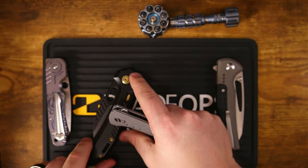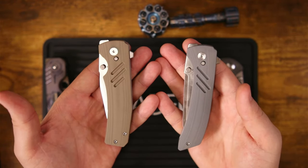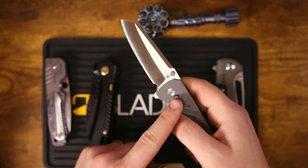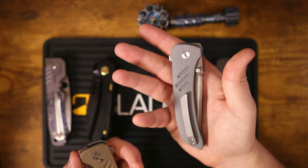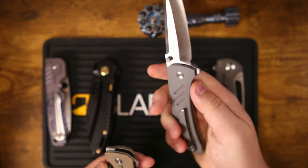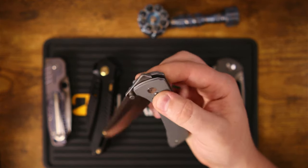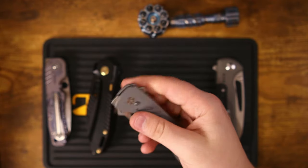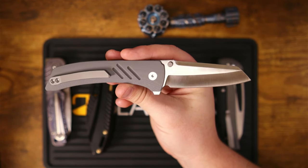It also allows for the ease of use because if you want, you can still use the liner to actuate that lock. So this one offers more options and very similar stability to the compression lock without actually stealing any IP or design language. These Dark Bolt Design knives are so great because unlike with the compression lock, you can actually unscrew this tab altogether and still use the knife like a liner lock that still has two stop pins. They took an existing idea and adapted it to be used for people that rather prefer liner locks, but the liner lock can be actuated with this tab. Just like with the compression lock and the plunge lock, it keeps your fingers outside of the cutting path while maintaining a real detent with smooth action.